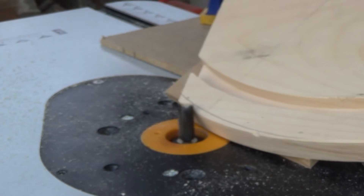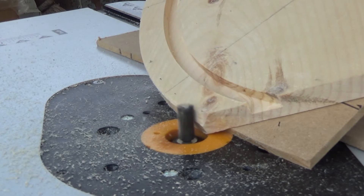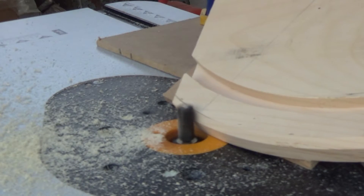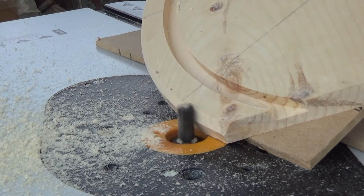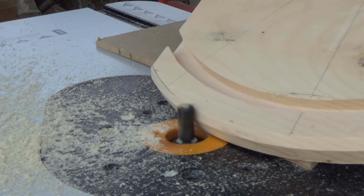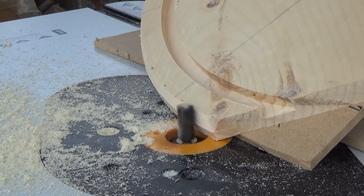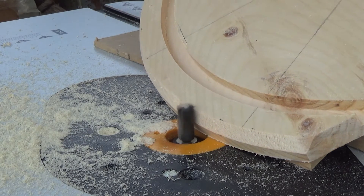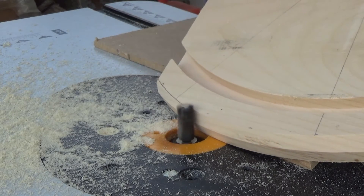If it does flex, it's going to cause you to mess up your piece. What I'm doing here is slowly taking off small chunks of wood, moving it in closer and closer every time. You don't want to take off too much because it's really hard on the router. I am using a soft wood, so you don't want to make any mistakes. All I do to make this piece is slowly move it into the router section by section, then unclamp it and push it down a little bit further into the bit.